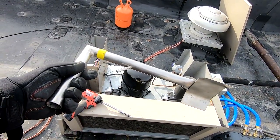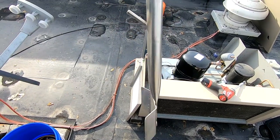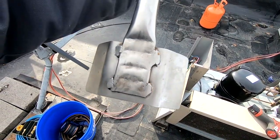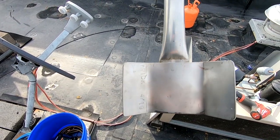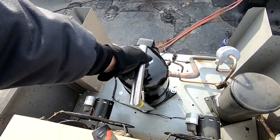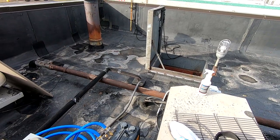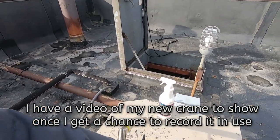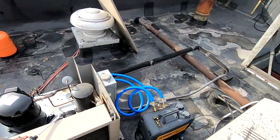If you watched my video on tools I built, I said I was going to build another compressor puller. I made this one out of stainless steel so it's never going to rust and it'll look nice. Went ahead and welded it up with a MIG machine - my gas wasn't quite right so the welds didn't want to buzz right, I had to grind those down. You really need a tri-mix when you're doing it. I stamped my name in there so if anybody decides to borrow it - it's definitely one of a kind, fits right on there. I'm going to put a hook on it for when I bring it to the roof. I did just get an electric hoist, 120-volt, for my ladder crane, so I won't be doing it with a drill anymore. It's a little heavier than you'd think when you're trying to pull it straight up with a thin rope.